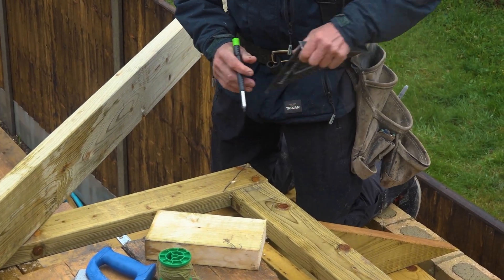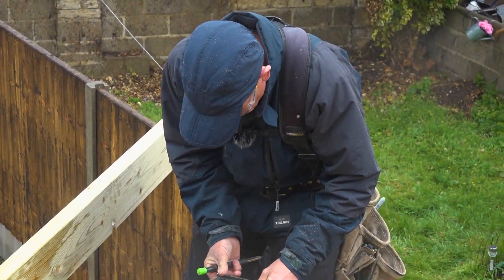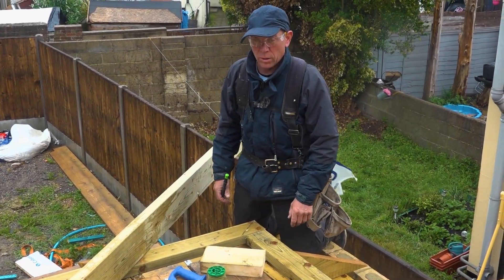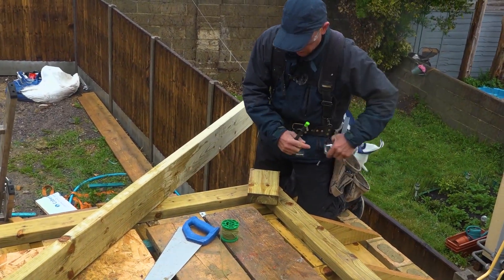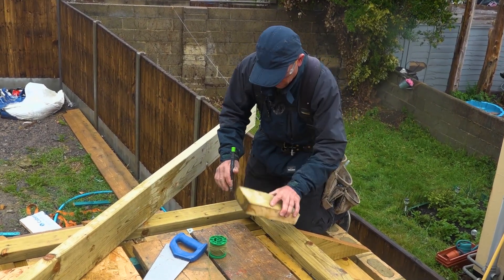It's quite strange not going through at 45 degrees. I can measure that off with a speed square — so that is 38, 52 there then. So we've got 52 and 38. Another way to double check — if you didn't want to do all the maths — that piece of timber is 127mm, just cut it down. That is the height above the plate.